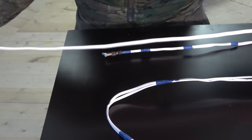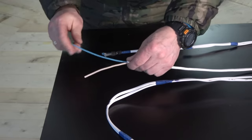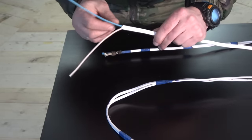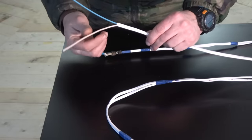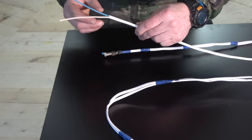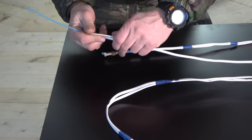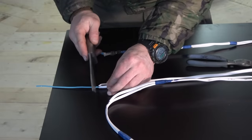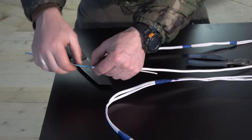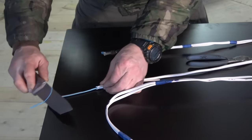First up, we're going to take a piece of electrical wire. We have a zero here — the blue one, or the null, or the negative, whatever we prefer to call it. And this is going to be the phase, but it doesn't really matter. Since I'm an electrician, I like to keep the color codes as they are. We take the phase and just bend it down here. We're going to strip the insulation from this, let's say, about one and a half centimeters — a little bit more than half an inch.